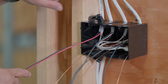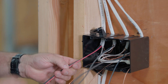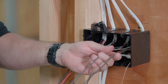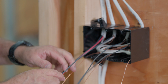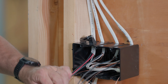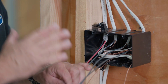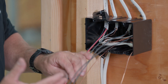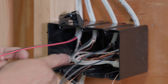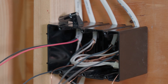Looking at the wires coming in, these here are the travelers for the three-way. This I've identified as my hot conductor. This here is a switch leg, and here's another switch leg. Some journeymen like to put their hot conductors on one side, some like to put it right next to the stud — it depends on what your company does or what your journeyman teaches you. So this is the hot, and I'm going to push it down to the left because I need to pigtail off three hot conductors to go with each of the switches.